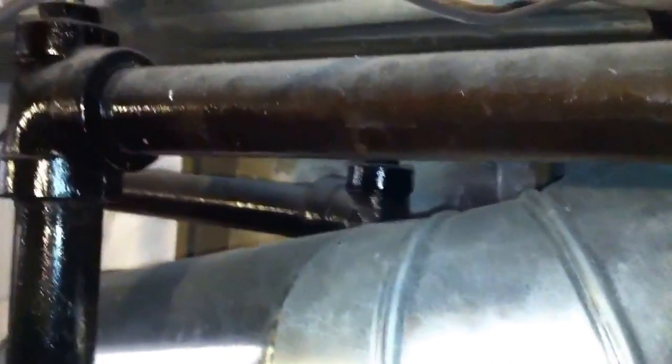She's starting to get very hot — oh yeah, can't even touch it. This is a nice little pipe that comes in from over here, up and over, and also from the left side up and then this way. This right here is pitched towards the boiler and runs back down — that's the moisture that will collect at the radiators. Same thing on this side. You can see this left one goes down there.